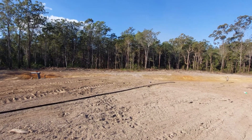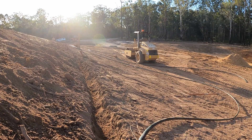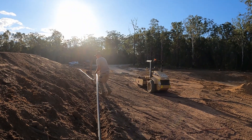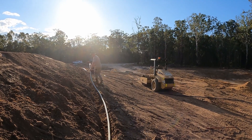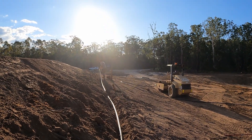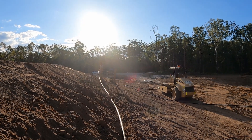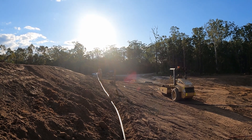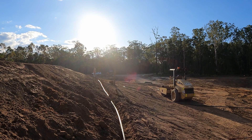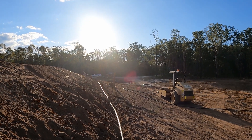After about half an hour, we had all of the twists undone. Now we're trying to place about 100 meters of poly pipe all at the same time. There are two things that are really helpful when laying poly pipe. The first is if you have somebody to help out and hold one end in place. And the second thing is if it's a nice warm day — the sun really helps to smooth out the curves in the poly pipe so that it lays down nice and flat.